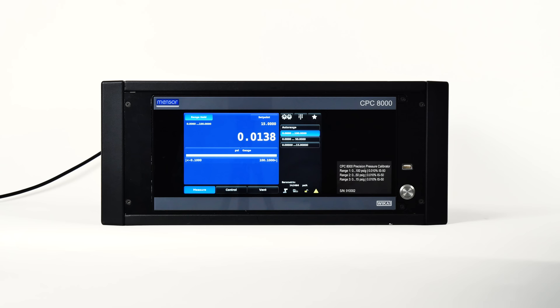This large number in the middle of the screen is the pressure reading of the active transducer connected to the measure/control port. When this reading turns green, it indicates that the pressure is within a user-defined stable window. The number will be white when the pressure is outside of the stable window. A red reading indicates that the reading is 7% greater than the upper limit of the active transducer. Inherent internal safeguards are set to prevent overpressure.